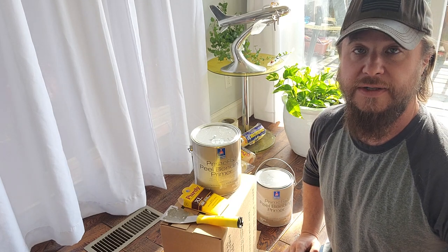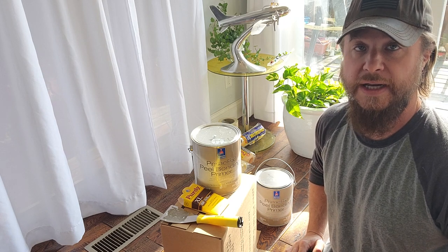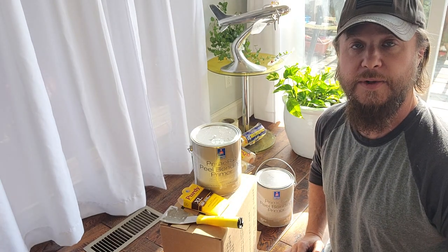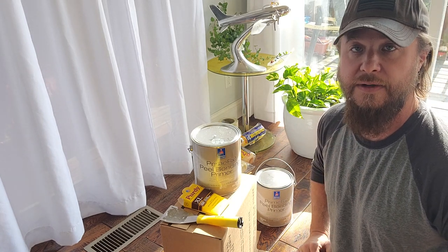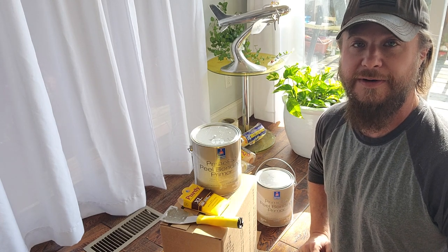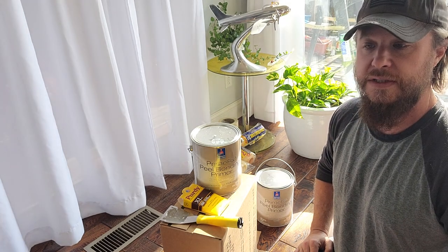As pretty and natural as this cedar is, I want to cover it up in this case. It's from 1967, already shows a little bit of age. I'm just going to put a shell on it. We'll deal with this in 12 to 15 years when it's time to refinish — sand it down mechanically and do a real good strip-down restoration. Right now we're just going to do a really nice durable finish without taking this finish down. There's the beam we'll be working on. It's pretty ugly right now, so we'll get out there and see exactly what we're dealing with. I'm going to start prepping it with our scrapers and sanding sponge.